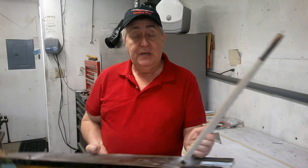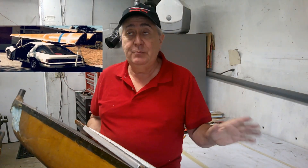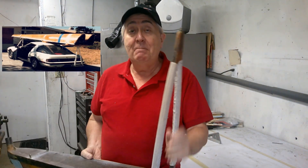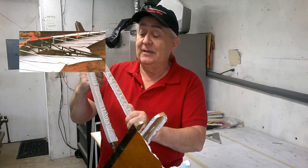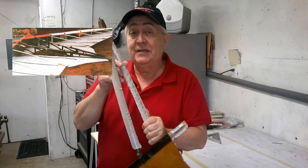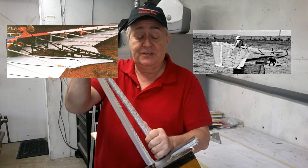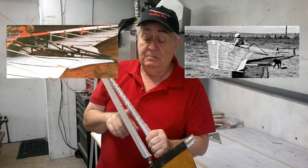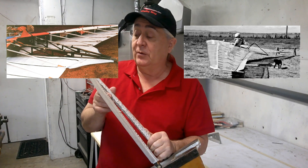I know I've shown this in other videos, but here's one of the ribs. The whole thing folded up for transportation — two packages, the two D-tubes, and the ribs were all folded up and the fabric was rolled up. Making these ribs, figuring out how to make them so that they didn't have any end bracing, and yet they were strong enough to take the loads and the elevon loads — when the elevons are attached on the trailing edge — was a tad tricky. I went through 13 different methods before I got one with the appropriate strength-to-weight ratio.